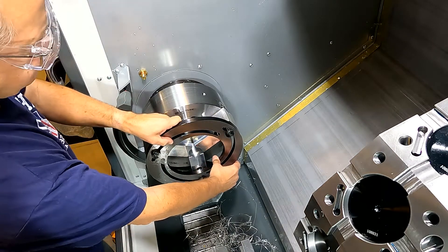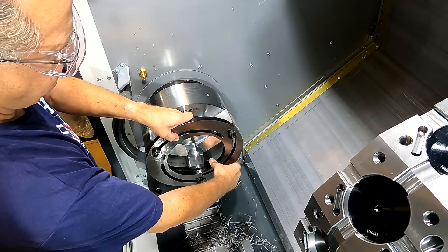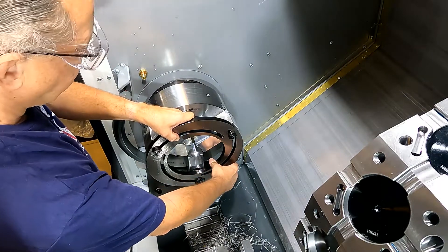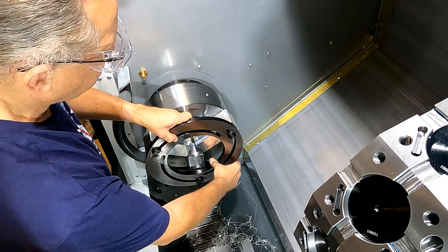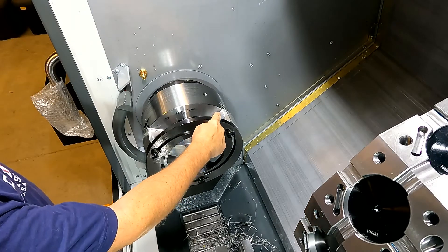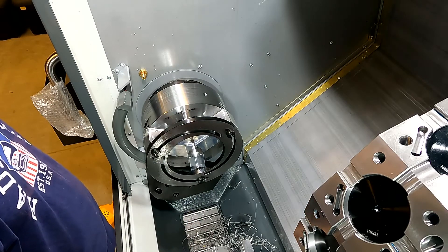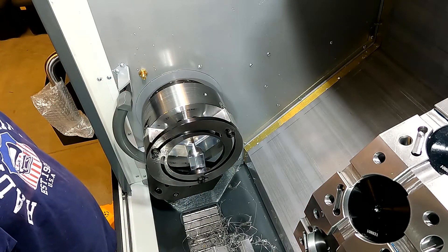So let's see if we can make it a bit farther out. I'm going to unclamp, rotate it just a bit, and clamp again. This time we're a little outside of the middle of the zone. So let's see if we can make it perfect. Yes — we are in the middle. There's an outer mark which is too far out, an inner mark which is dangerous because you may not get enough travel to achieve full clamping, and then there's a sweet zone in the middle. We're now right in the middle of the sweet zone.